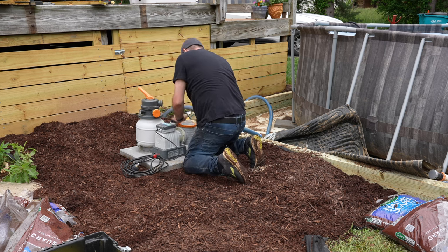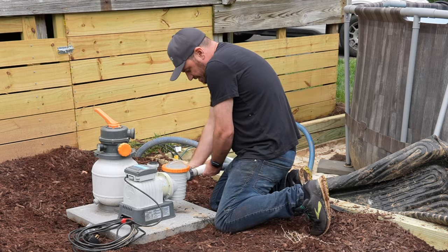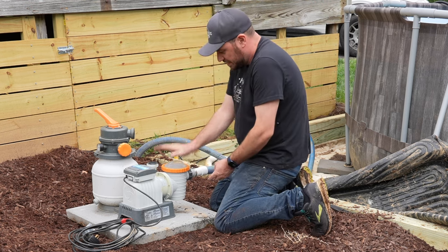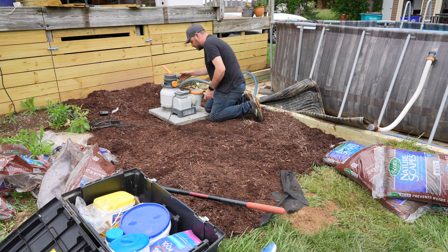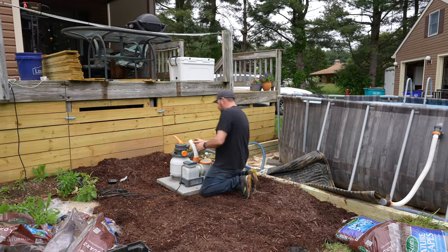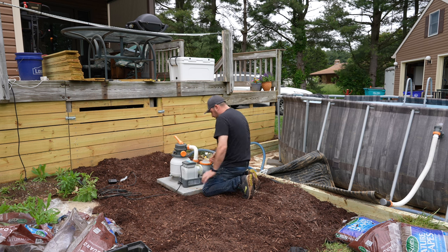Sits like that. Intake. As I have the pool filling up and we're a couple inches away from the skimmer. So as soon as it hits the skimmer, it's gonna start sending water into this pipe, into the pre-filter. So I need to get this part ready before I go and get distracted doing other things. And I gotta remember how to do this. I'm pretty sure this goes to this. Pretty sure. I had it mostly right. Well, I had it right. This goes here. I remember because it doesn't sit on this little platform well at all. It kind of sucks. So in, gets pumped in the pre-filter, in here, up into the top of here, down, and then the output is right here.